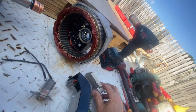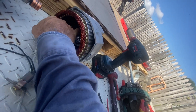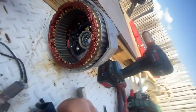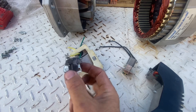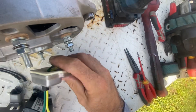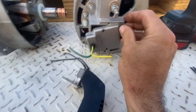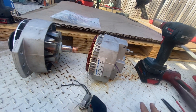We don't need any of that for external regulation, so I'll just cut that off. You could technically just cut these two wires out, but I don't like how they sit — they can catch on the back end of the rotor. So what I do is take the wires out, the spade terminals go onto this unit, and I modify the external cover by drilling it to the same size as the rubber grommet hole inside. That makes a nice sealed point for your two field wires to come out. Assemble it back together and it's ready to go.